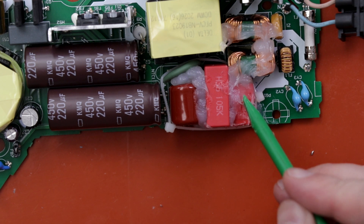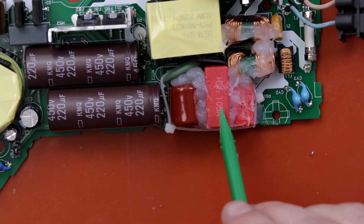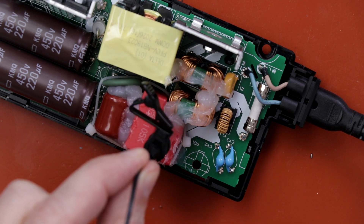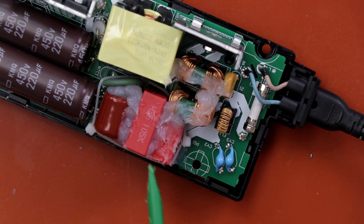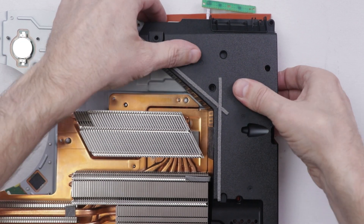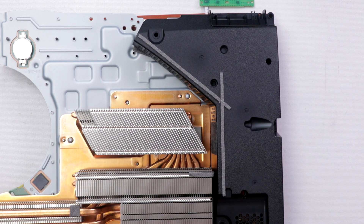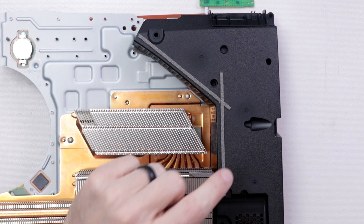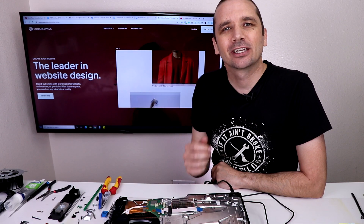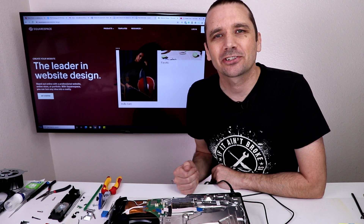It's got all of these capacitors zip tied together with all the silicone in between to hopefully dampen any vibrations. Now it's time to plug it in and see if we've gotten rid of the noise. The noise is definitely less than when we started, so I'm going to get this power supply back together and then test it hooked up to the PS5. Right about down in here is where those capacitors are, so I'm going to pass my mic over this area. Now just with my ear I can hear a little bit of a buzzing noise coming out of here, but really not much at all. Thank you again to Squarespace for sponsoring this video — be sure to go to the link in the description. Thank you so much for watching and I hope you have a good one.